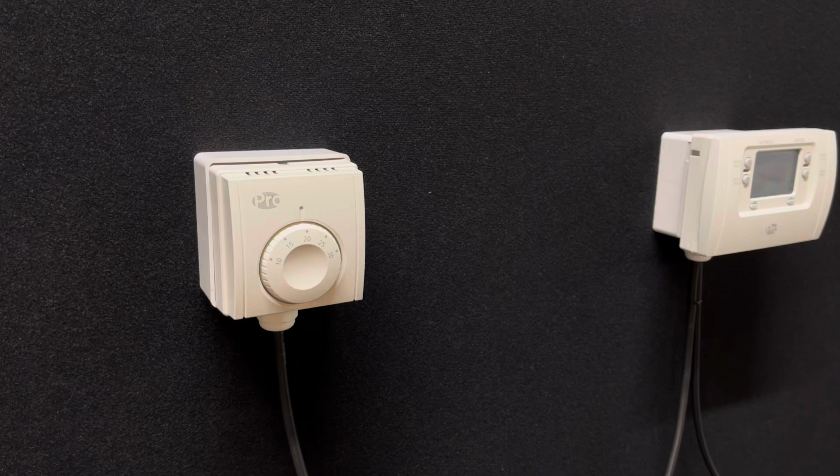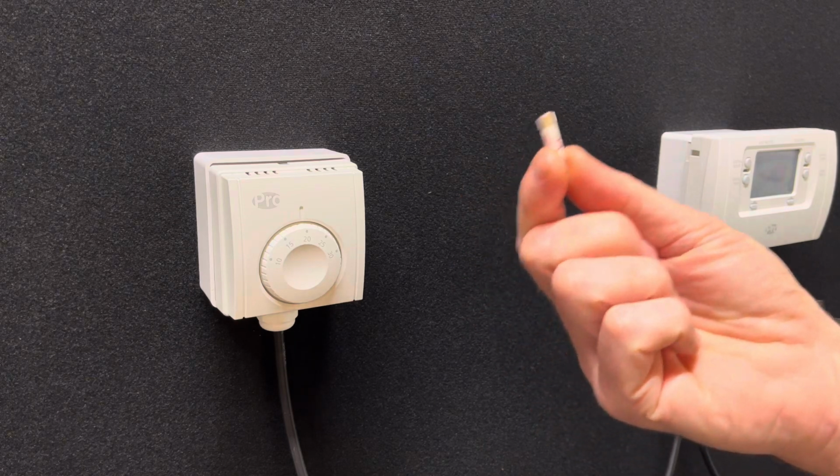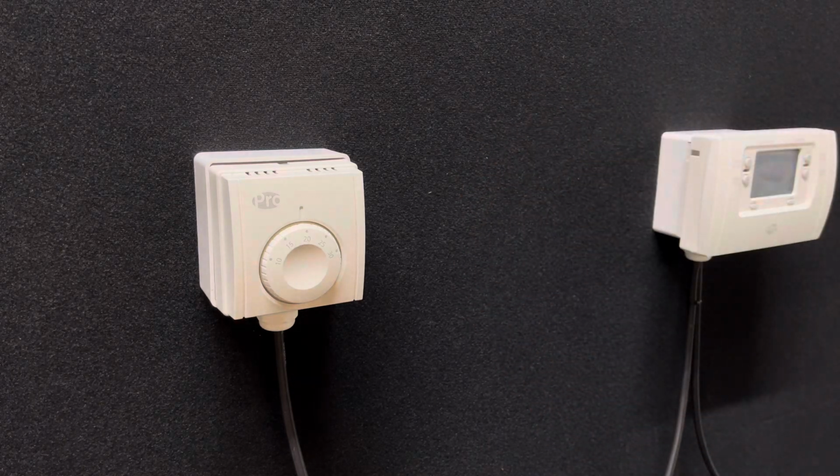Okay, so now everything's isolated at the switch fuse spur, and you've got the fuse actually in your hand. I'd suggest putting it in your back pocket so no one else can easily put the system back into commission while you're working on it.